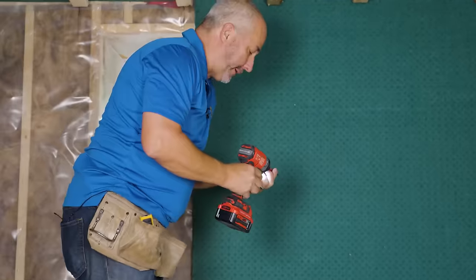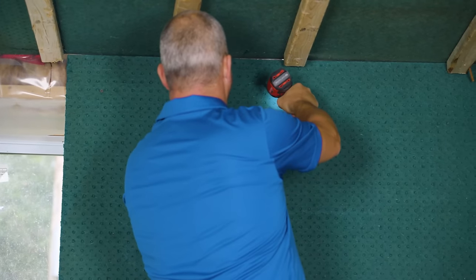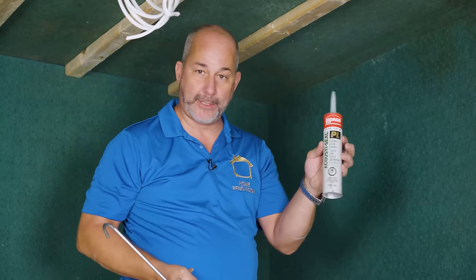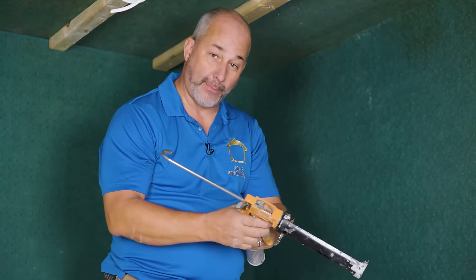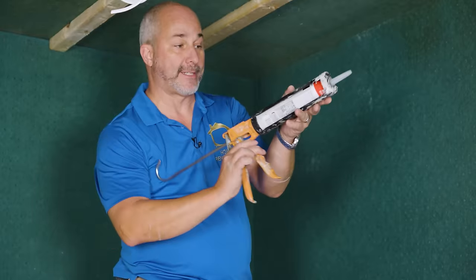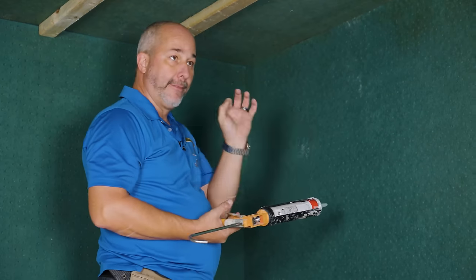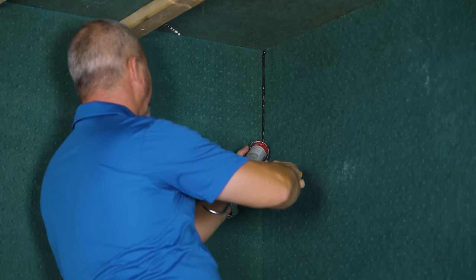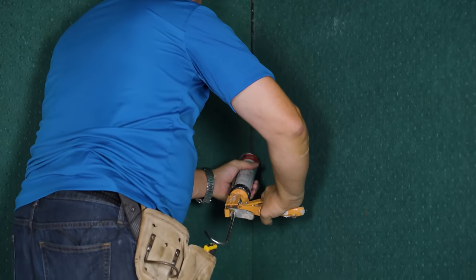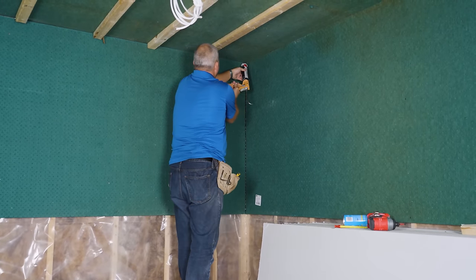The fibers are hard on your mouth so wear a mask when cutting. Whenever you build with wood it's never as tight a seal as you'd like. There are two ways to seal up gaps: one is this black acoustic sealant — we use it with vapor barrier to seal plastic to wood or metal framing. Treat it like caulking, put a nice thick bead, don't tool it or wipe it in, just get it on and get it done.